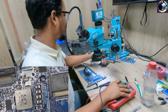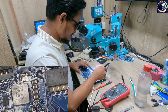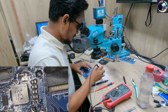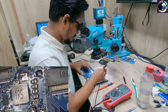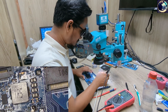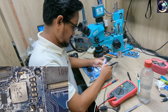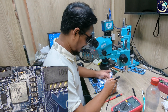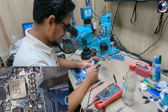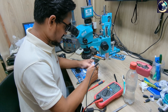I'll put some solder smoke here on this side. As you can see here, this capacitor — there are two very tiny capacitors, capacitor one and two — they are connected to this secondary IC. These capacitors can also be short. This capacitor looks faulty. So I'm going to put some smoke here so I can easily identify the faulty one. As you can see, capacitors one and two are connected with this secondary IC, so one of them can be short. I can guess this capacitor is faulty.